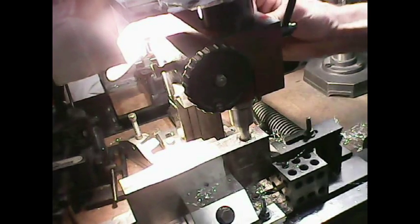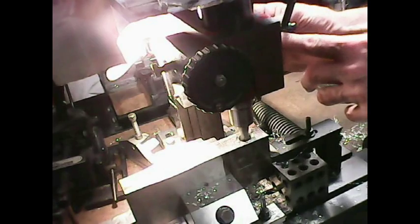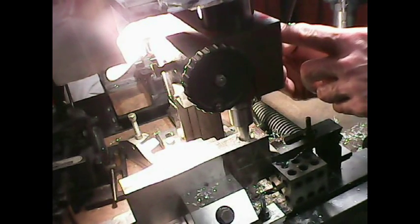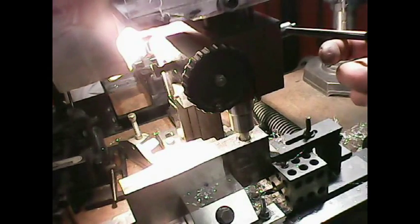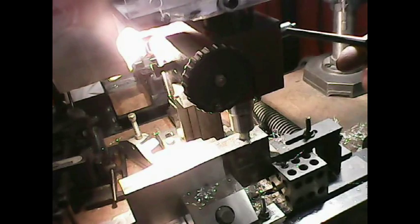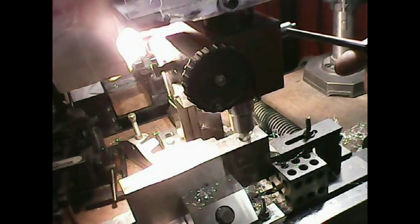Okay, let's see where we're at now. Alright, let's get this back to 0 here. Right there. Okay. 100, 200, 300, 400, 500, 600, 700, 800, 900, 1 inch. Then 150, 200, 250, 300. Okay, I have it set up on 300 thou now on my quill. And that's about it right there. So it's actually starting to pass a little bit now. Alright, we're bottomed out. That's it. Base diameter.